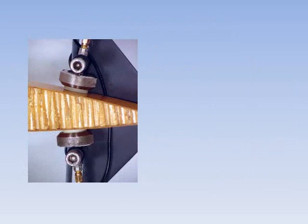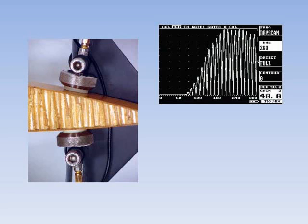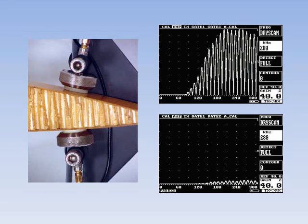Let's look at how that works out in practice. If we have a probe on either side of the material — in this case a tapered honeycomb structure — with a good area we have a high level of sound transmission, and with a bad area we have very low levels of sound transmission.